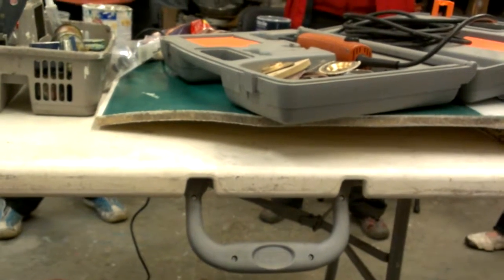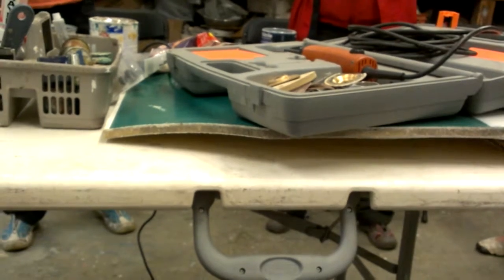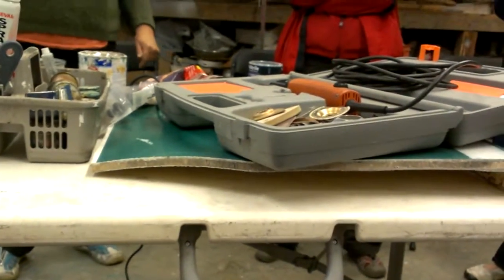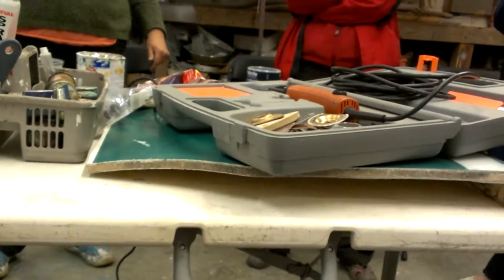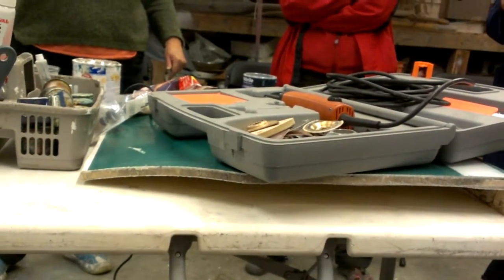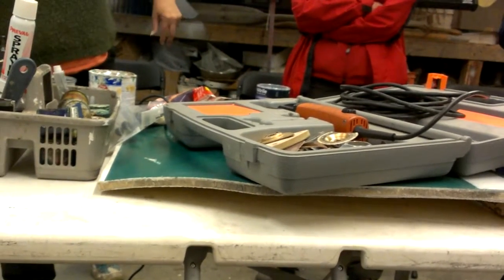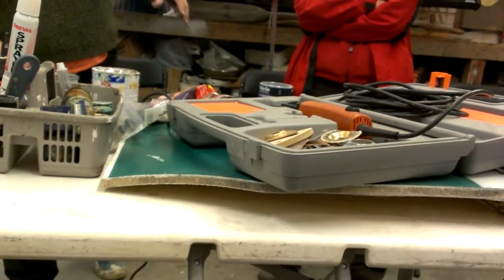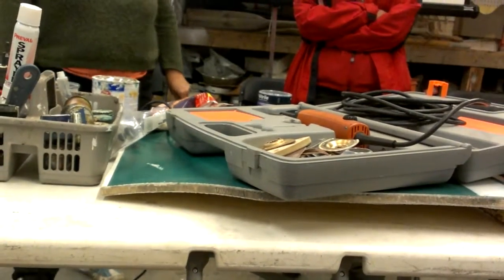So all of those forces go down to that plate where it is on the deck. Those little forces might not bend the stanchion, but are enough to break the seal of whatever caulking you've got underneath there. So all the water runs down into those holes, gets to the core, and goes where it wants.